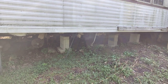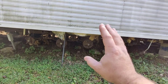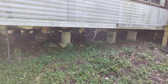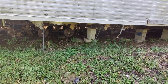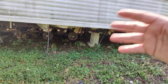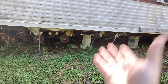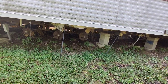If you can get underneath the trailer — if it's got underpinning — take a flashlight. Maybe bring a friend if you don't want to crawl under it. Look at the condition of the insulation underneath the floor. You want to see if the insulation is sagging or falling down, because you'll have to get that fixed. Also see if the insulation is soaking or has a lot of moisture in it, because moisture coming from the ground gets the insulation wet, it falls to the ground and molds. A lot of trailers should have a wrap underneath that holds the insulation up. Check to see if that's in good shape.